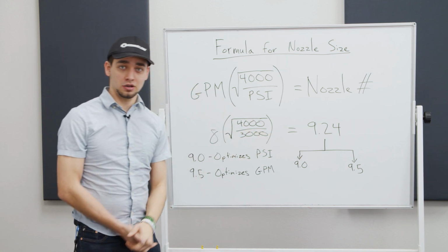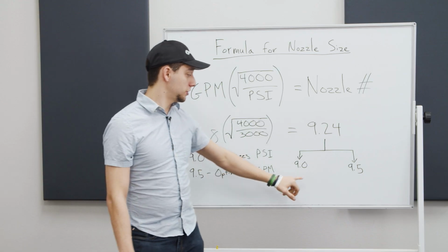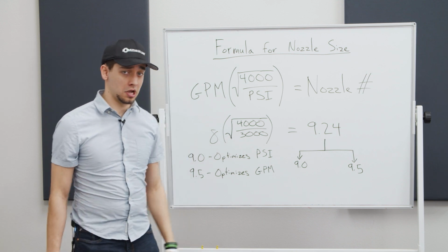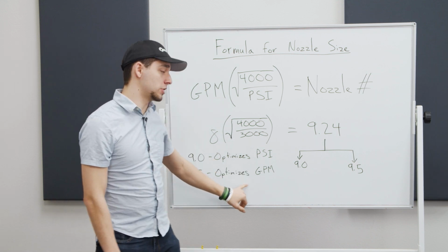Well, you're like, well, Theo, I don't know what to do now. I'm in between 2 nozzle sizes. So you can actually go for a 9.0 or a 9.5. It's really up to you what you're trying to do, what you're trying to optimize. A 9.0 is going to optimize your PSI. A 9.5 is going to optimize your GPM.